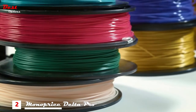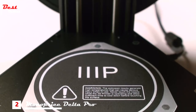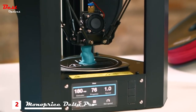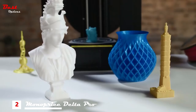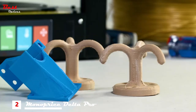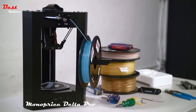Our design uses an open filament system, meaning you can use 1.75 mm PLA or ABS filament from any brand. The removable heated build plate improves print quality and reliability with different filaments. The all-metal aluminum construction increases durability and reliability while still maintaining its lightness. Whether it's printing a toy, a model, a replacement part, gadgets for your everyday life, or your own creation, this printer can do it all. You'll get professional quality prints at resolutions up to 100 microns.